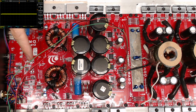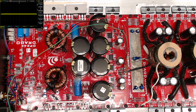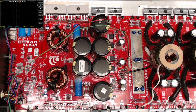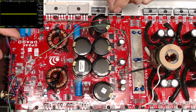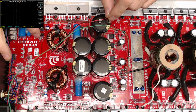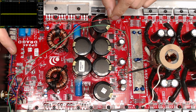Now, I have the two CMOS gates installed. I have one drive IC installed. So I'm wondering, do we try and see, or do we pull this IC here just to make sure I don't have any shorts? It shouldn't matter, because the drive IC is on the output of the gates. So I don't know if the shorting of these CMOS gates has anything to do with the drive IC. I don't suspect they do.